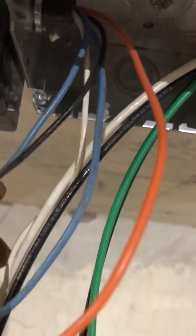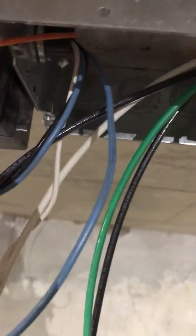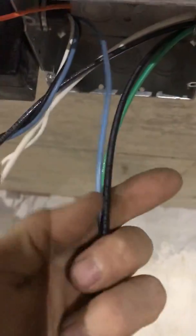So I'll have a blue and a black going to the feed side, which feeds the power pack and the relay inside — those go together. The orange gets capped off. All that's left is the remaining blue wire, which is the one that goes out to my lights.